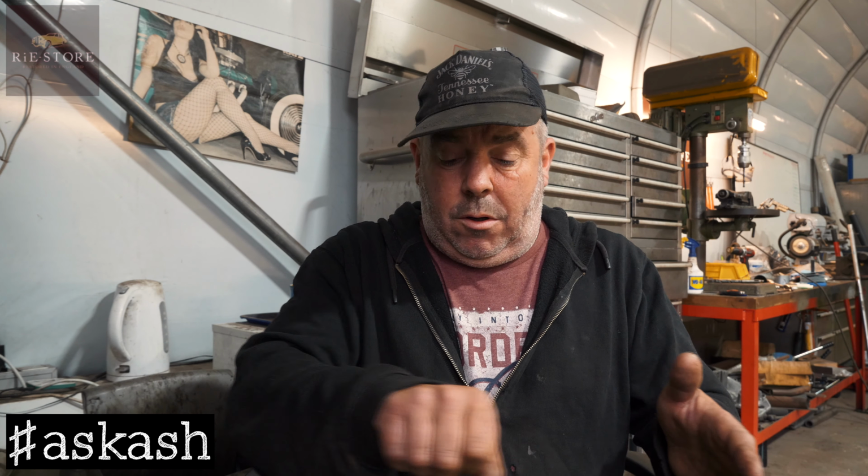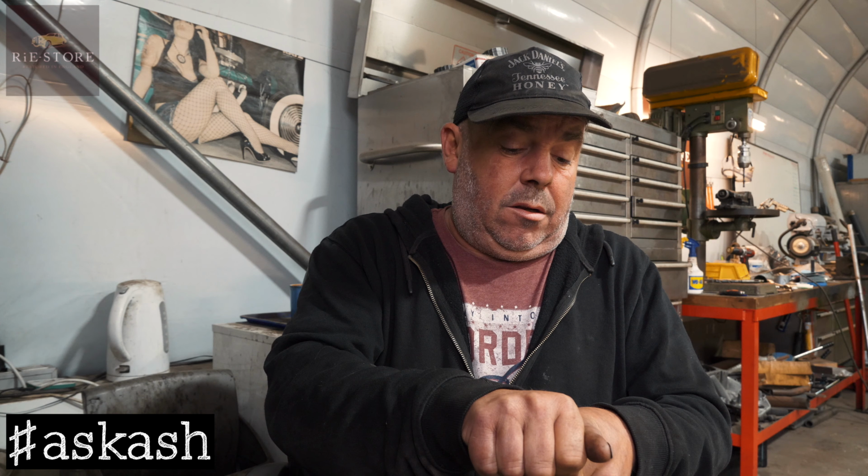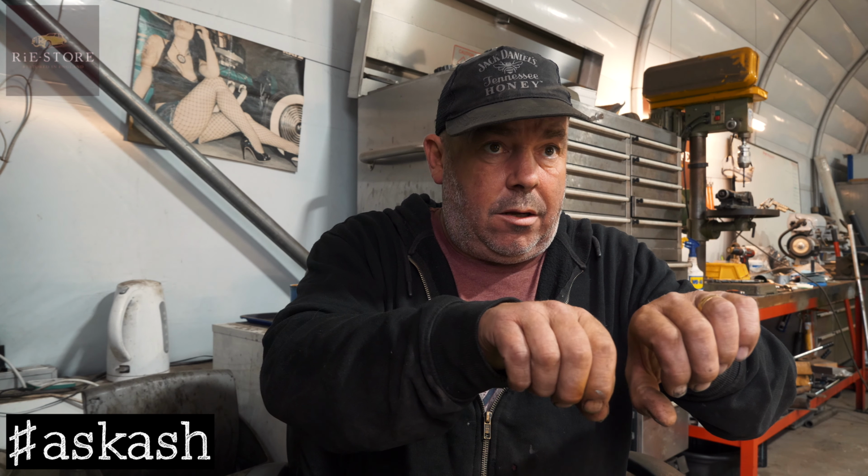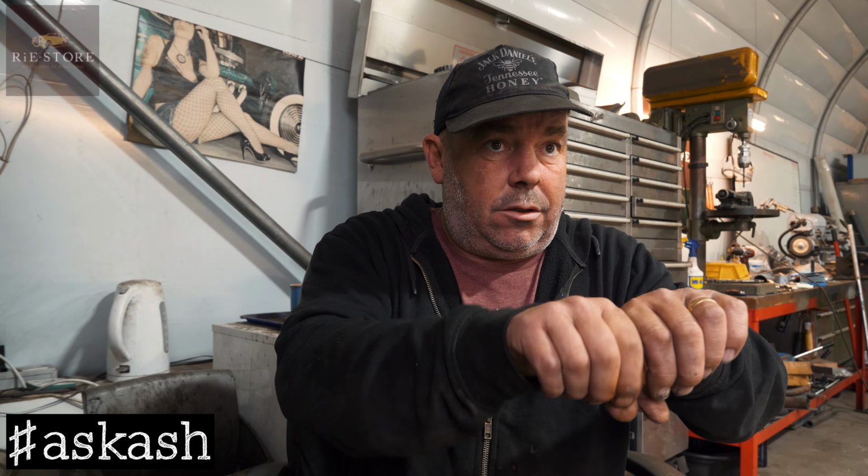Yeah, there's quite a few moving parts in there, but before you put the nut on the end, the handlebar slides up and you've got where the handlebar comes along and raises like that, then you put your twist grip on. If there's a big gap there, you know there's something wrong in this end, because that should sit snugly against the raised area. You just got to go through it bit by bit, see that everything's sliding where it should do.